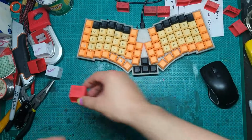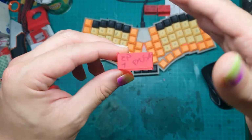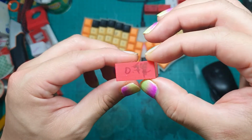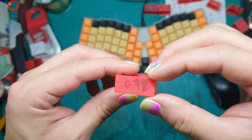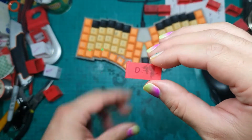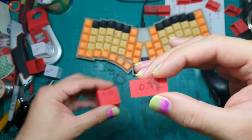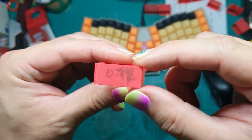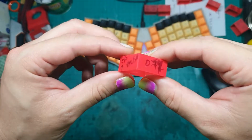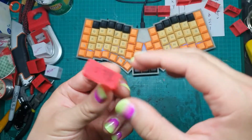Why is this happening? So I went to Prusa and did the same thing with my perfectly calibrated setup, where the extrusion multiplier in Prusa was just 1. And I printed this two perimeter cube and I got 0.74. So I would say that's pretty good. That's just a tiny bit off, but it's certainly much better than 0.68, which is really, really under extruded. So in Prusa, I might have to actually do something like 1.05, something like that, to get more accurate. But at this point, 0.74, 0.75 is good enough.